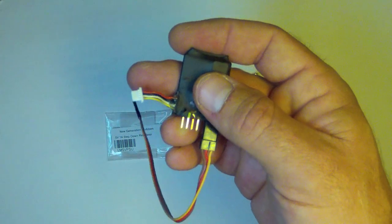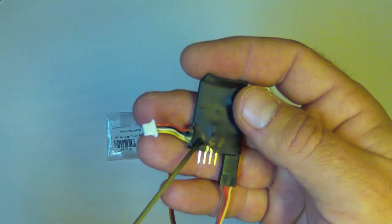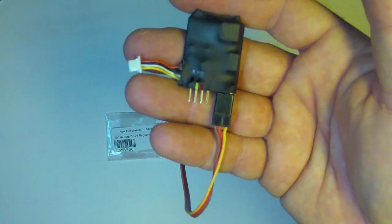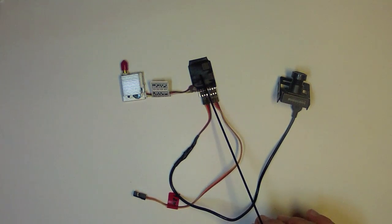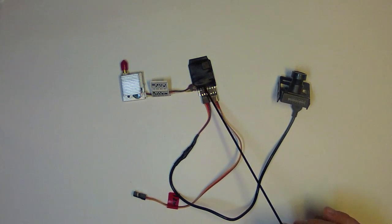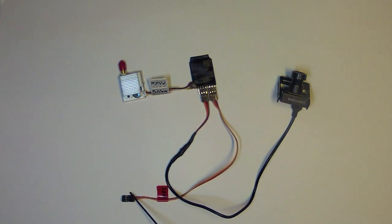You do need fairly fine soldering skills because these four wires must be soldered to the printed circuit board. There's a small bridge beneath this area where you can designate whether the camera gets 12 volts, 5 volts, or no volts. Here's a typical setup with the LawMate transmitter hooked to the New Generation Hobbies power supply, drawing 5 volts. I have a ready-made RC 700 TV-line camera which draws 12 volts through this line, so that bridge is soldered internally to deliver 12 volts.